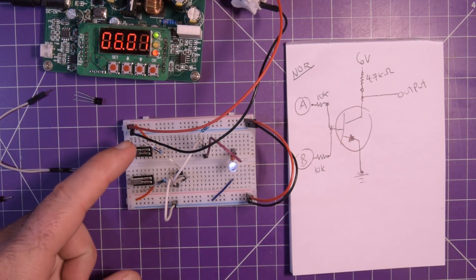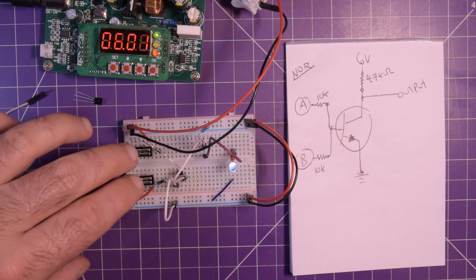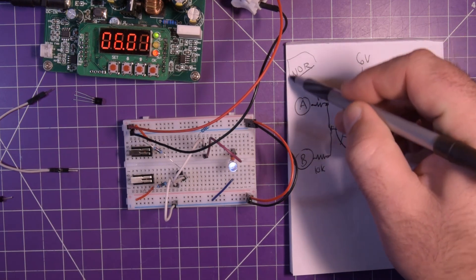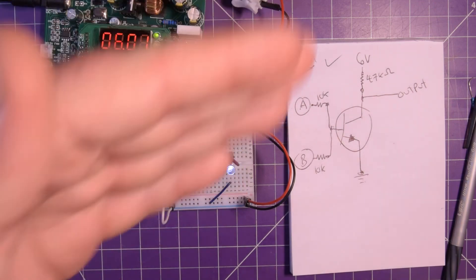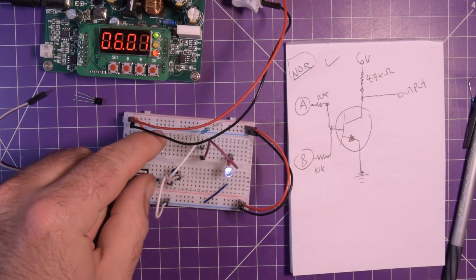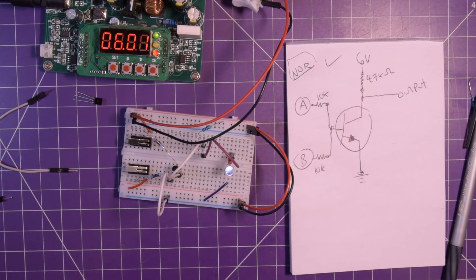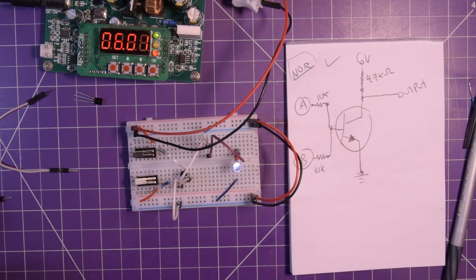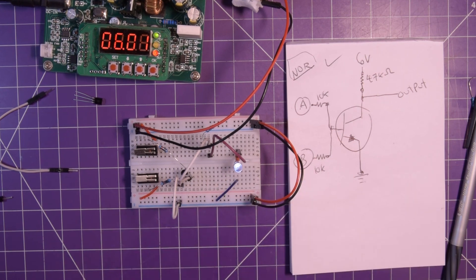The LED turns on. Click this switch — it turns off. Click the other switch — it turns off. Both together — yep, either or. Another completed logic circuit! I encourage you, if you have these parts at home — just one NPN transistor, a couple 10k resistors, and a 4.7k — I don't think those exact values are critical, anything in the thousands of ohms should work. A couple jumper wires or resistor lead cut-offs and a couple switches — micro switches, toggles, or push buttons. Try this, let me know if it worked for you, and thanks for watching.